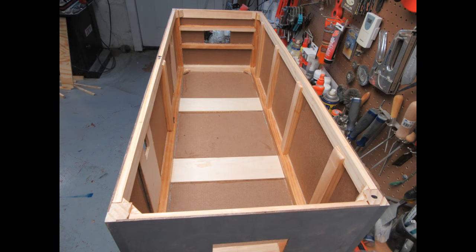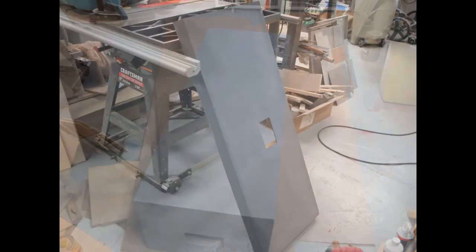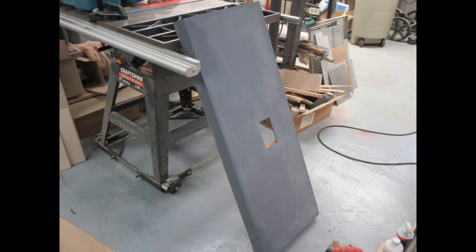Here all the woodwork on the case is complete. From this view, it is apparent that most of the case surface is still only the 1/8 inch masonite, which allows the case to be much lighter weight than it would be using plywood throughout. With woodworking done, a final coat of gray primer is applied. Remember that the first two primer layers were given a light sanding when the second coat was complete.